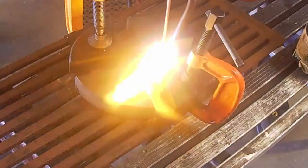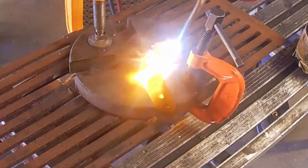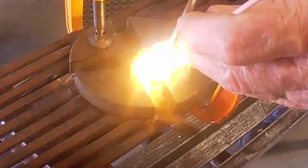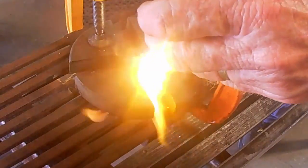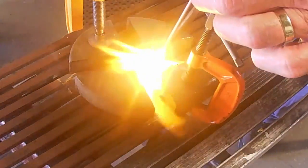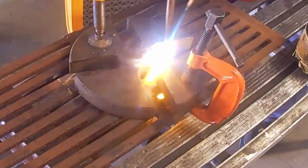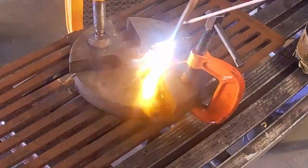It's hard to see from the video position, but the work surface is raised at the camera end so that the casting joint is running downhill. The brazing sequence I follow is to start from the lower end, effectively forming a brass dam wall. The idea is to minimize the loss of braze material that would flow out the open ends of the groove.